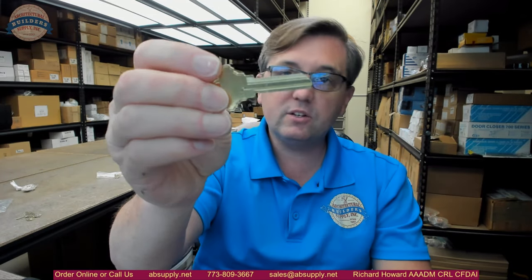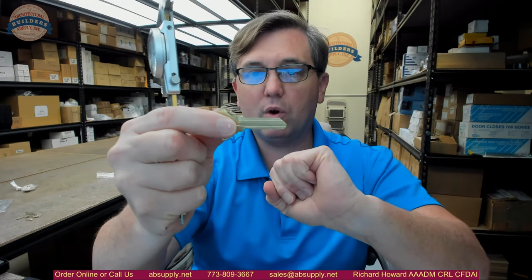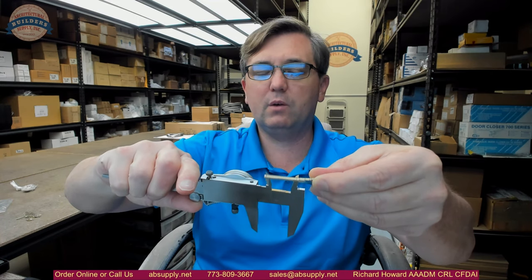That's a six-pin blank — I know that just because I can tell by the length of the blade. Let me give you some dimensional properties. A blade height of the key blank is .343 inches overall height. From the shoulder stop to the very tip, I can estimate fairly accurately with the caliper — I'd say that we are right at 1.186 inches. There is a link below this video to the manufacturer's page where we can get to the Kaba Ilco key blank catalog for more information.